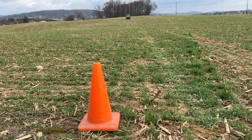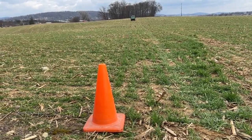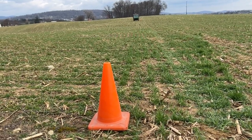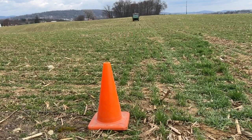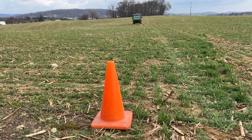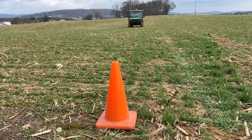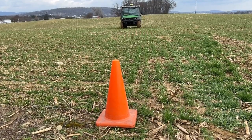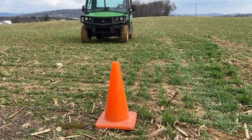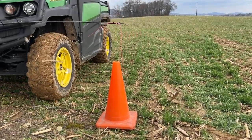You're going to pause the recording right where he's at now for a reference point, and while paused, drive to the other cone. Same thing you did when you dropped the cones and worked your way out. Now as he comes back to this cone, it's not actually recording until he hits resume. Once he hits the other cone, it's going to snap a straight line between the two, so we could have two different fields that share a common border with directly touching lines that don't overlap.